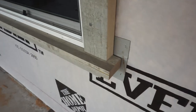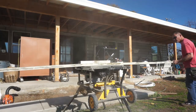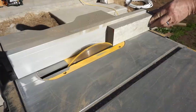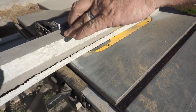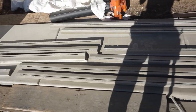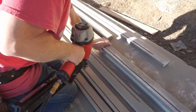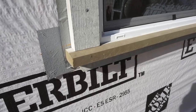This looks like finished window trim — you're looking at the first finished windowsill. You can see a few details on it, like that bevel on the top and the 2x2 on the bottom. Here we're going to show you how we cut some of those pieces. We took a full length of true exterior composite 2x4 and ripped it in half on the saw. Then we set the saw at an angle on a full-size piece of 2x4 — a different piece — in order to cut that bevel. We just kind of eyeballed it until we got the look that we wanted. Just a little bit of extra detail and one of those things you might notice later. With the bevels all cut, we then cut dados into each one, that's the slot for the window, and nailed these to the bottom piece that sits below. And with that, you see the finished windowsill.